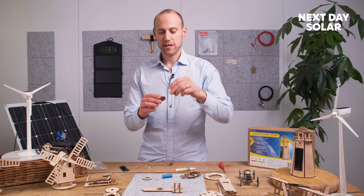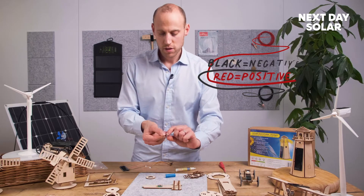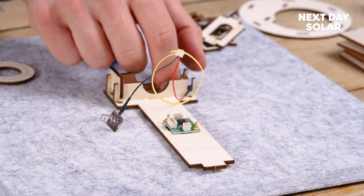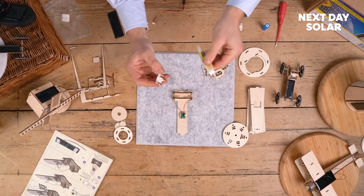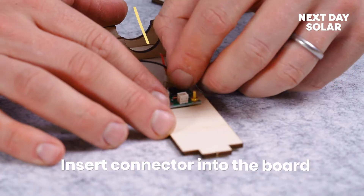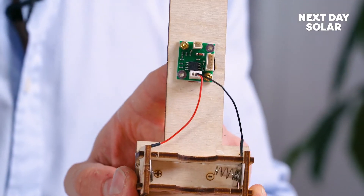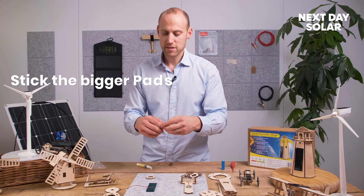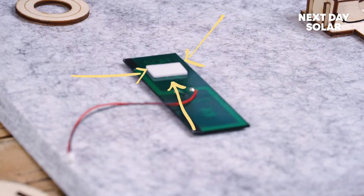Next we're going to get our battery contacts and insert them into the battery holder. It's very important you get the right ends - the red being the positive. Position that down that end and your cutout will come into play now. I've taken my positive and my negative and placed them, and now I'm ready to apply some glue. Then we're going to insert the board connector into our circuit board. So I've got my positive, my negative and my connection. Now I'm ready to move on to the solar panel - I'll take my two foam pads. This is a nice four volt solar panel - one pad at the top just avoiding the connections and one at the bottom.